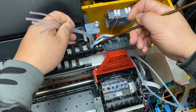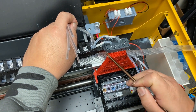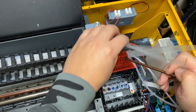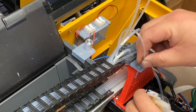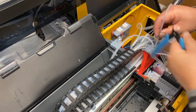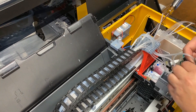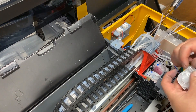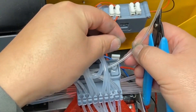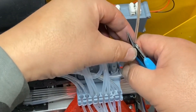The C3 tubes — one goes to the left and one goes to the right. It doesn't matter which one goes to which side. Underneath is the white ink tank, which balances the pressure when you're printing. For the five C2 tubes, four of them go to dampers. The C2 tubes have five lines — four do the color dampers and one is the maintenance tube that goes to the maintenance tank.